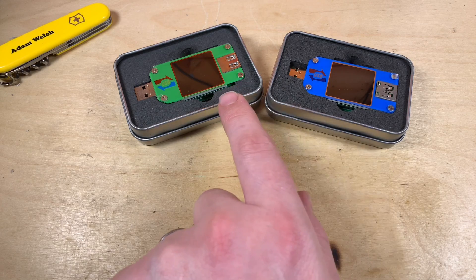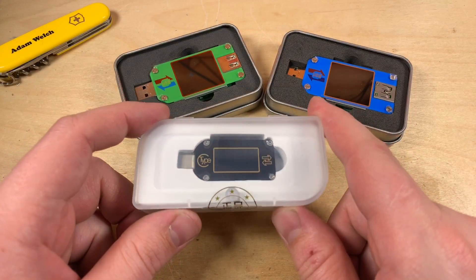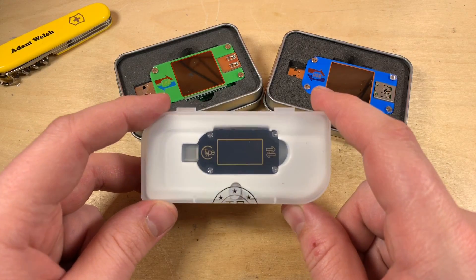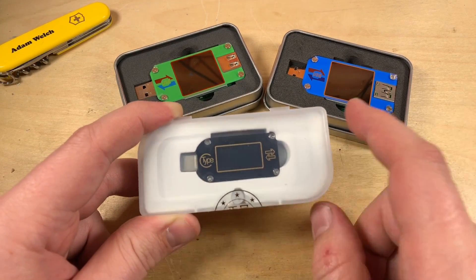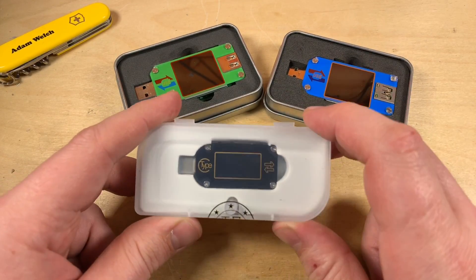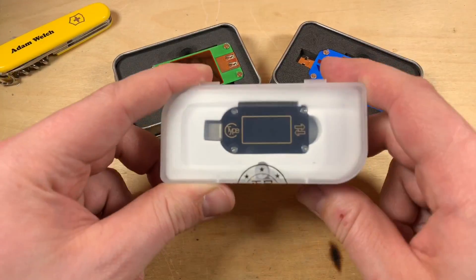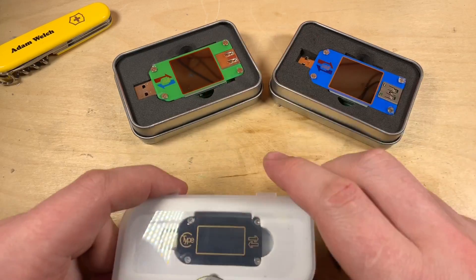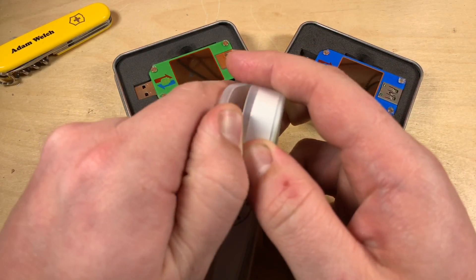So the UM34 was a little bit less accurate but did USB 3 things. And now we have this — the TC66 USB-C USB power monitor. This one will read from practically zero volts up to 30 volts and will measure up to 5 amps as well, and it's more or less the same accuracy as the UM25, so it's pretty impressive. It's obviously a fair bit smaller than the previous generation of meters, and the T in TC may stand for trigger.